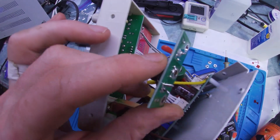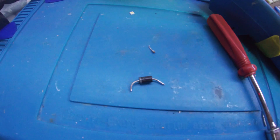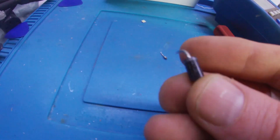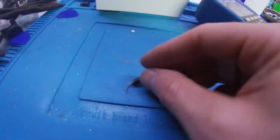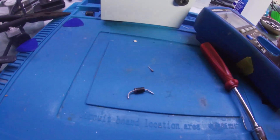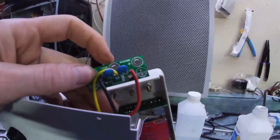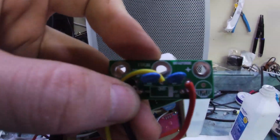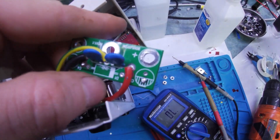It's just a diode and I'm just happy that I can get it going back to working condition. This diode is a 1N5408 diode and it's shorted. It's labeled D1 on this circuitry board right here, so I'll just get a new diode and pop it in there — should be good to go.